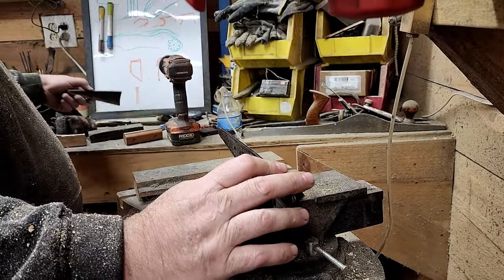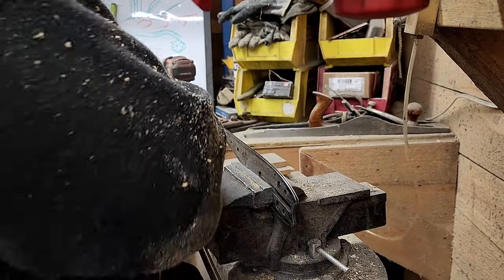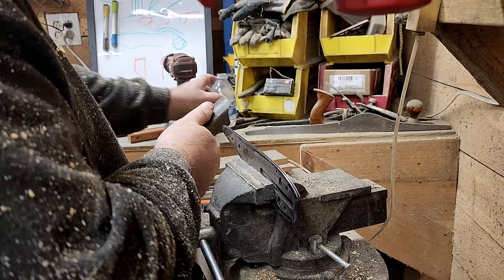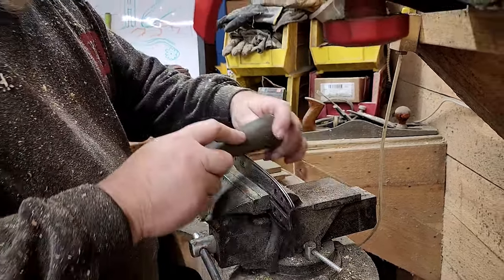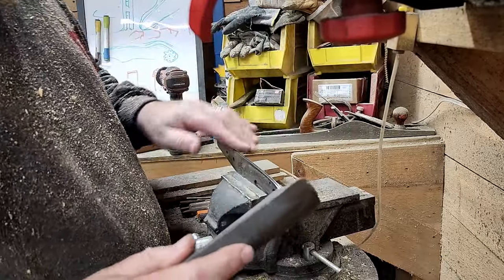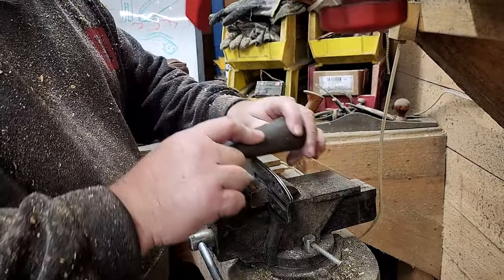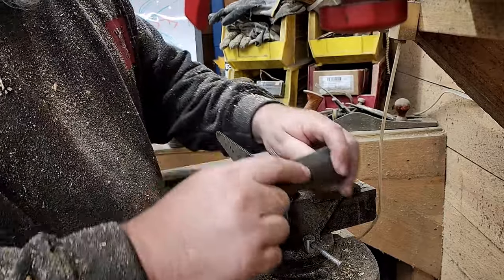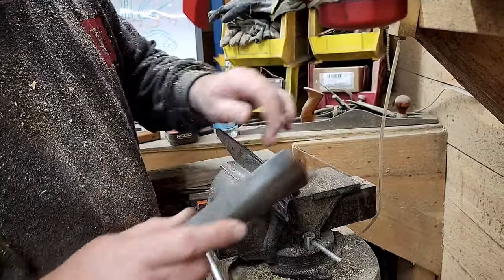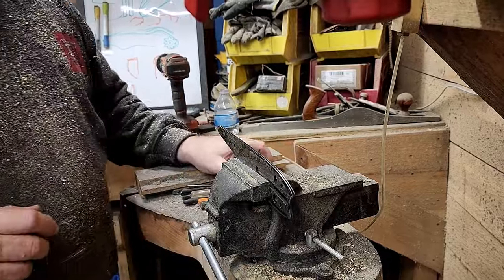Then I'll take a fine stone — like the kind for sharpening chisels, or any fine one — and I'll get this thing honed down. Normally I'll spend 10 minutes per side. Make sure you use the light and check that you've got all your scratches out. Some people say it's excessive, but when you see the chain run on a bar that's been honed like that, it feels just like glass.